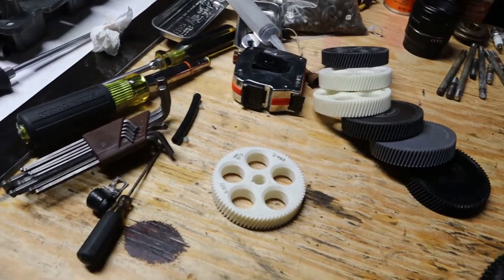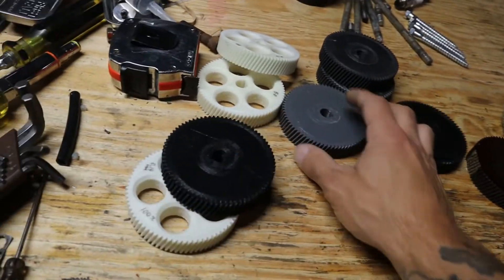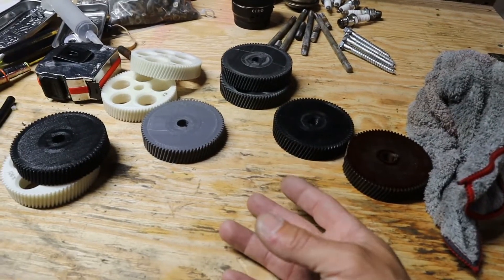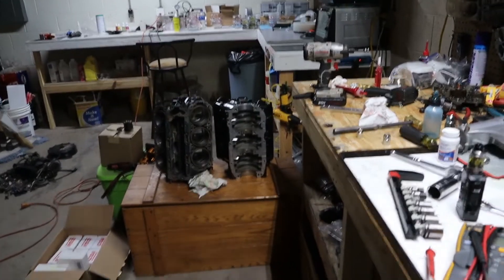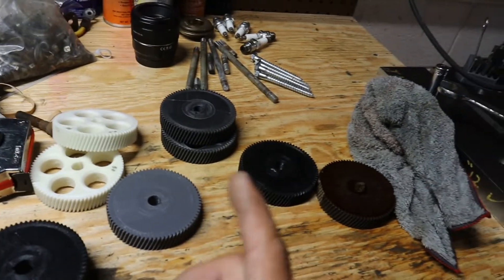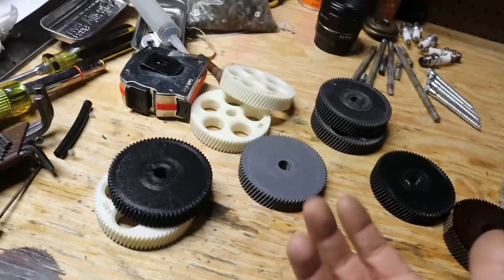I printed the first gear out of PETG — it's weak, super weak — but none of those are as weak as the gear that was in the machine. It was just a trial to test the shape. I chose PETG over PLA because it's more oil resistant, and this is an oil-filled gearbox. I bored three blocks with that one trial-run PETG gear, and it worked flawlessly — until the other day when I bottomed it out again and it ate the gear. So we're going to tear it down on camera, pull it out, and check the condition of it.